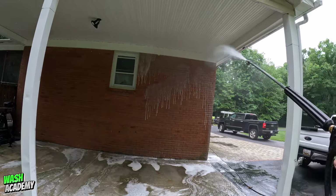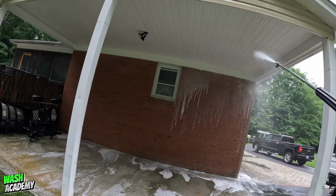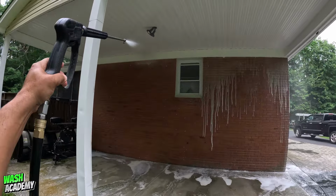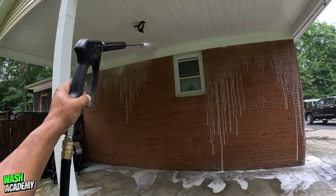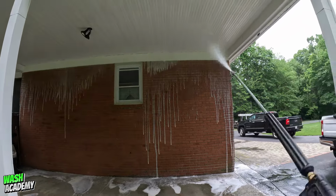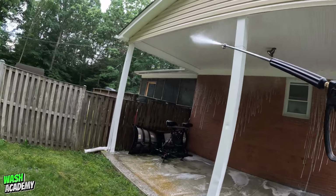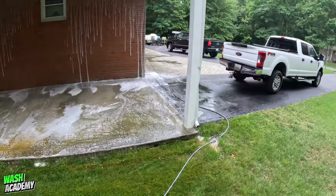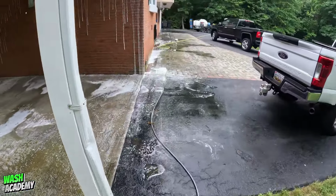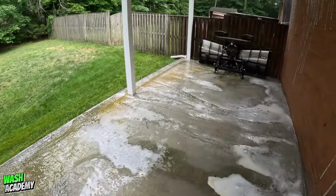I did a whole video. Oh, but you know what? That video is for members only. That's right, I forgot about that. On how we built my trailer. But I'm using a 10 gallon a minute machine, so it's getting diluted by the water that's in my line, coming out of my pump. Diluted down to about 0.8, 0.9%, which is right where you want to be for siding.